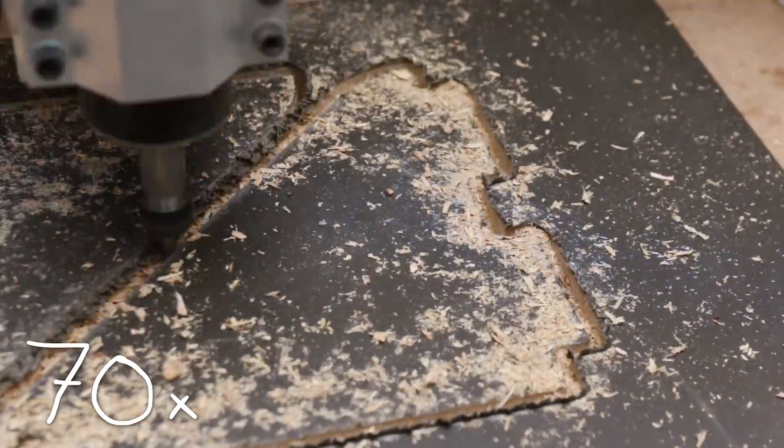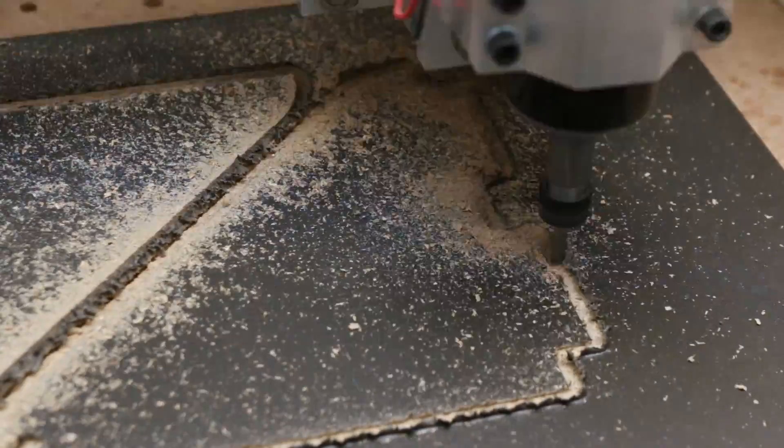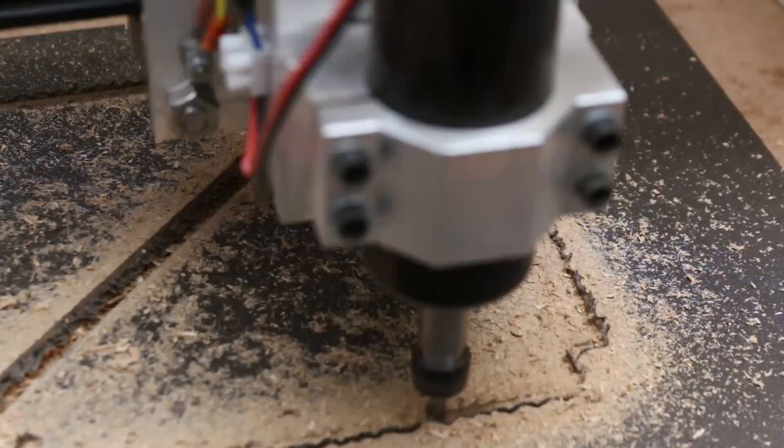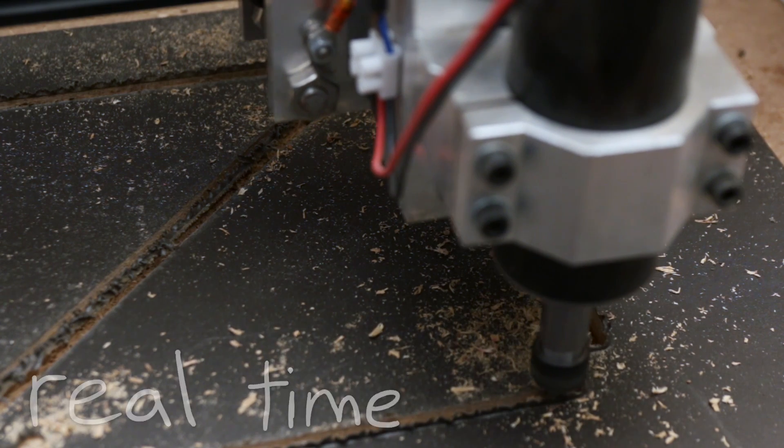The spindle and mechanics just aren't strong enough to take very deep cuts. The maximum I can go is about 2–2.5mm deep in a single pass. That's okay if your material is only 5mm thick, but with 19mm MDF — which is the material I use most — that's quite a few passes, and I also can't go too fast, so it really takes a long time. Because I'm not an engineer and didn't know much about CNC when I began, there are of course a few design flaws.